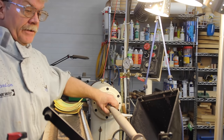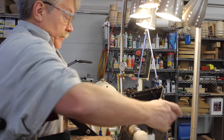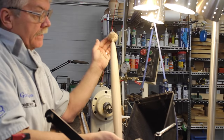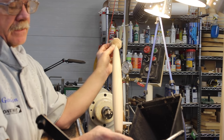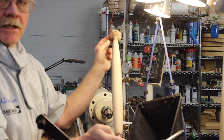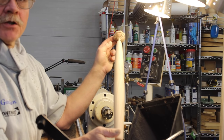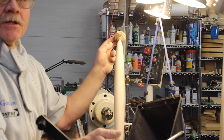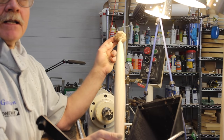And there we have it — in a little over five minutes you've got your piece ready. I'll take it off now, and we've got a really nice French pastry rolling pin. I'll just clip the ends with a finishing saw, sand the ends up a little bit, and put a food-grade finish on it, and it'll be ready for sale. Thanks for your attention. You can send me an email if you want the link to the newsletter at Gord at LangerCraftWorks.com.